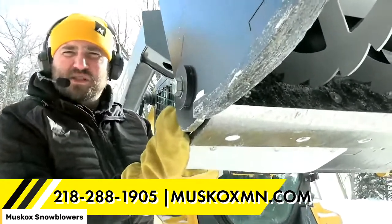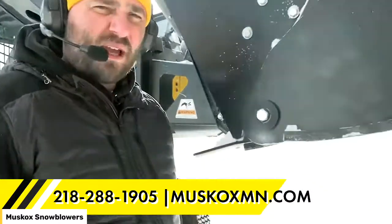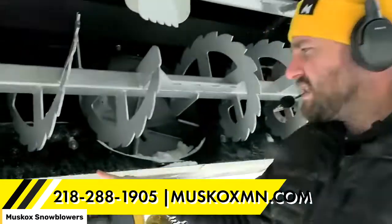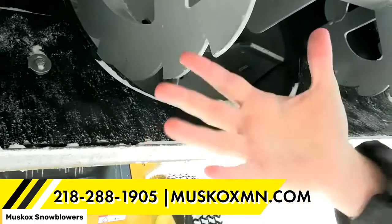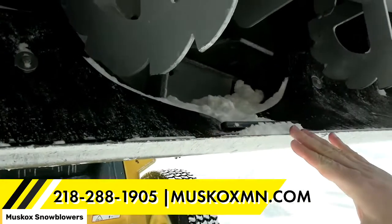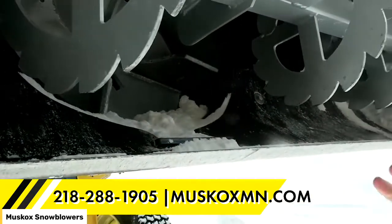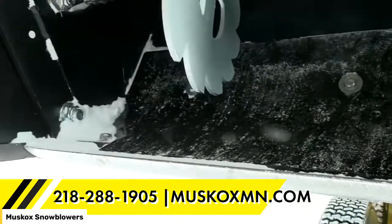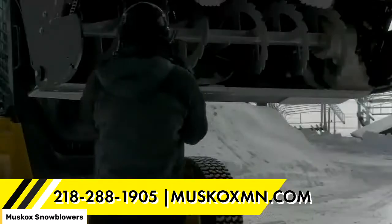Again, that's not to scrape surfaces, rip up grass, pick up rocks when you're going over gravel driveways. But then we have a very unique opportunity with this machine because at any time we can rotate that bucket and ride right on the steel cutting edge. So like I said earlier, this machine probably has 150 hours on it right now. We have not taken off that steel cutting edge. You can still see it's sharp and it looks brand new. So it really lasts a long time because we only use it when we need to. So then we're able to rotate the machine at any time to be able to ride on that steel cutting edge. Ron, if you want to go ahead and drop the machine one more time.